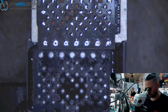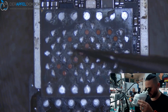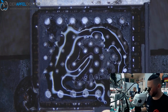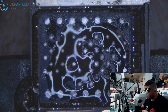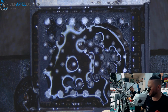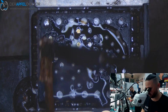Okay. And you can see, and this happens really often on the boards where you have a hard underfill. I really see this very often, that we have bad pads under the NAND. So a lot of them are NC. Normally always one pad goes which isn't NC, and you saw it was hard enough. I didn't have to use any force. It wasn't hard to take off the NAND. It was really soft. And except here you can see this pad is really bad too.